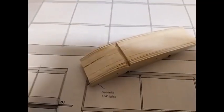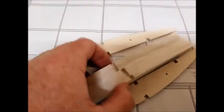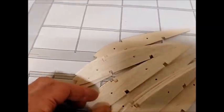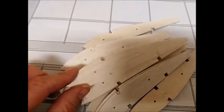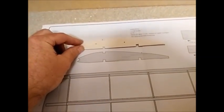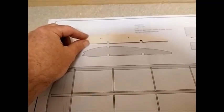Taking the toothpicks out of the whole assembly gives me 19 identical wing ribs. The holes remain in the ribs but they're in positions which don't take any loading, so it will be fine for use in the airplane. Next I'll check each rib against the template and against the plans to make sure everything is correctly aligned, then move on to the spars.